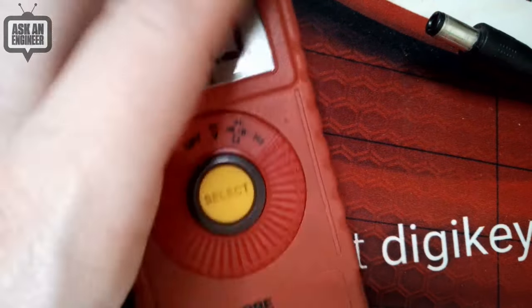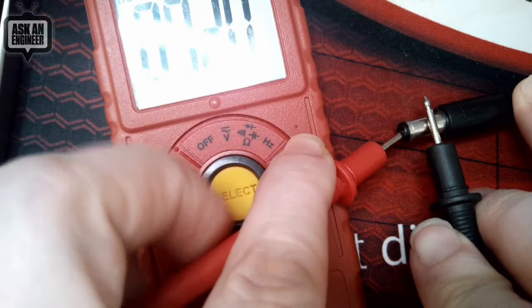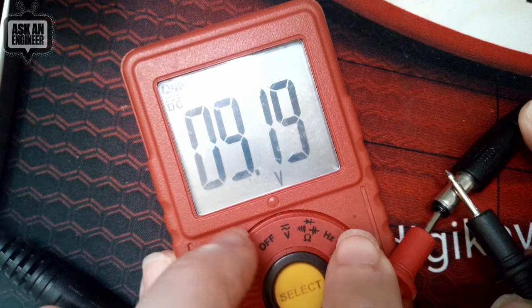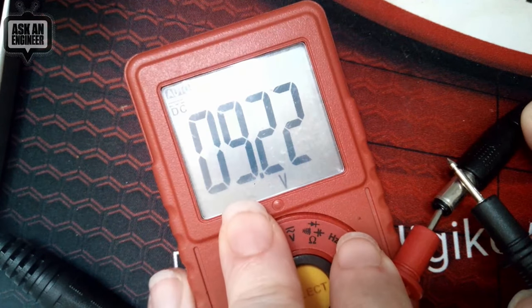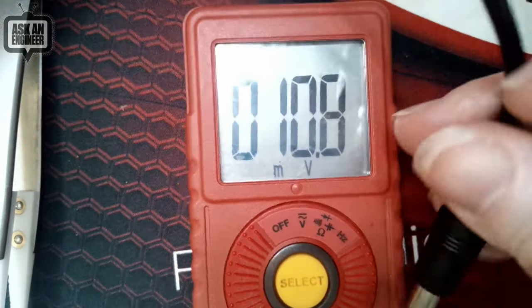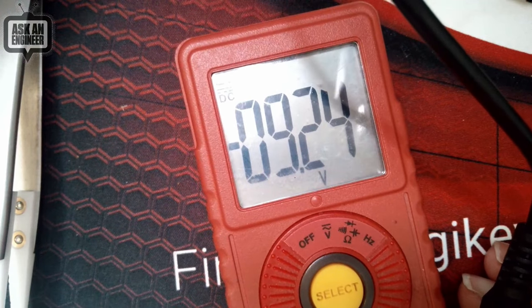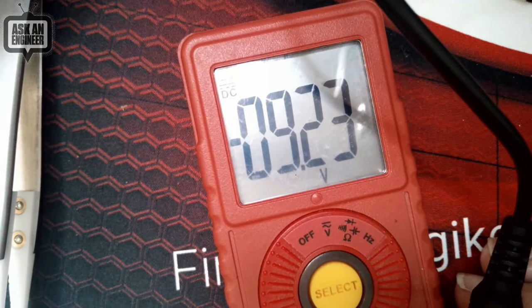Let me show this on the overhead — simple yet ingenious. With the multimeter it's normally 9 volts, center positive: the outer ring is ground and the center is red giving positive voltage. If I plug in the polarity switcher, now when I put the red probe on the inside and black on the outside, you'll see it's negative 9 volts. It doesn't change the voltage — it just swaps positive and negative.